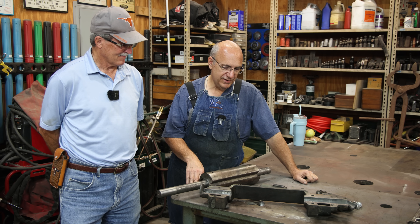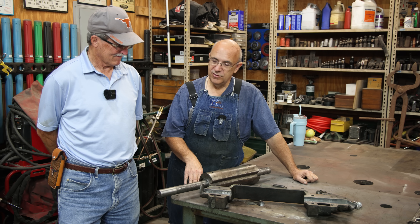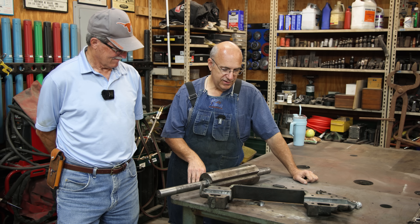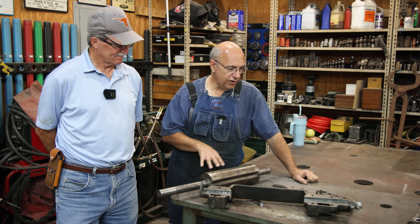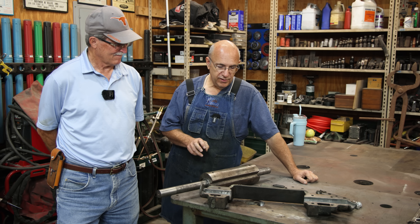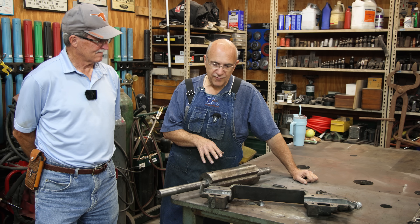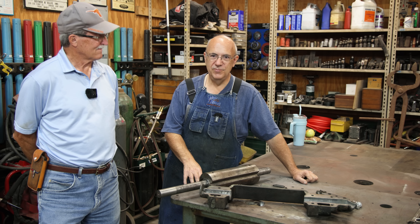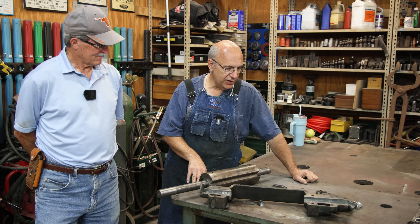But most of the time when I see a Babbitt bearing machine, the Babbitts usually are not in terrible condition. And if they are, it's no big deal — you just melt out the old material, re-pour them. When they brought it down and I took a look and started inspecting these, I think we can just work with what we got. Instead of having to re-pour new bearings, this actually does not look bad at all. We're going to do some work to them, tune them up. I think what I'm going to start off here is show you the process of inspecting these Babbitt bearings — when not to pour new bearings.